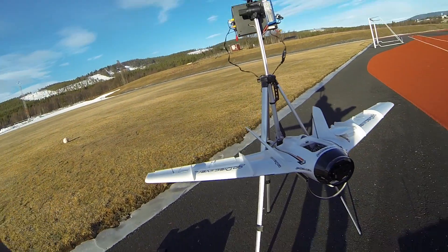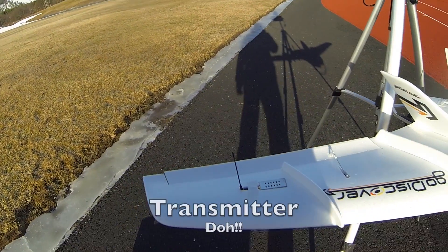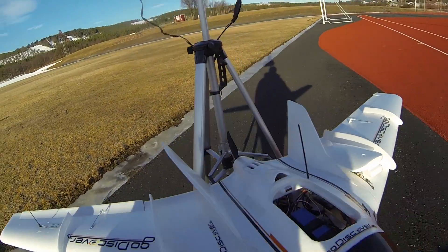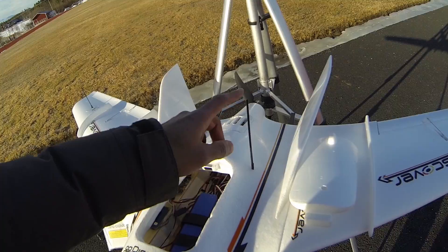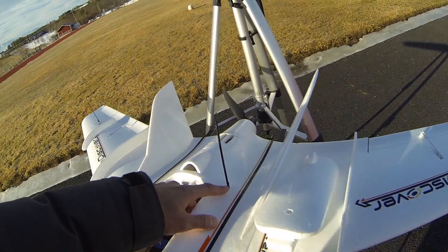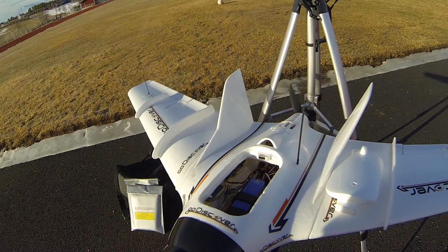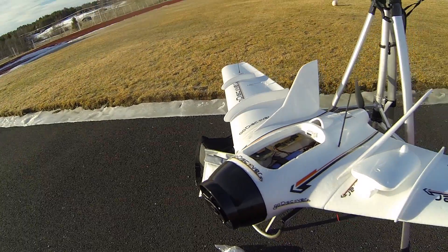For this particular flight, I've made a couple of changes. I've now put the video receiver right out here on the wing to have as much separation as I can from the dipole antenna of the Dragon Link. I'll probably later move the Dragon Link out onto the other wing, but I tested this yesterday and got 9 kilometers on the low setting on the Dragon Link.